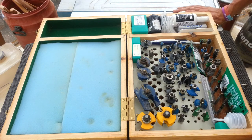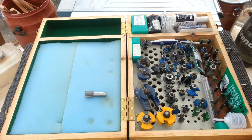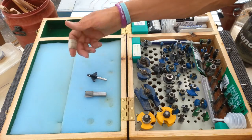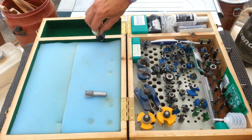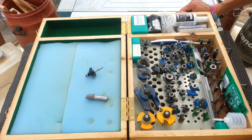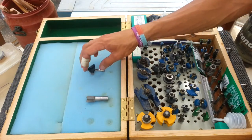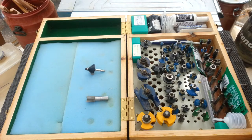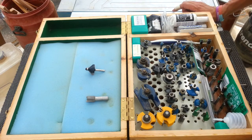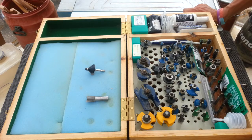So the individual cutters. I categorise cutters into two camps: bearing guided and not bearing guided. The bearing rides up against the workpiece at whatever height, which means you don't need a fence on the router itself. You can further subdivide those into straight cutters and shaped profiled cutters — and there are so many. If you look on the internet or find a cutter manufacturer's catalogue, the numbers of different cutters they produce are in the thousands, literally.